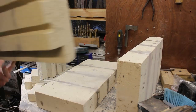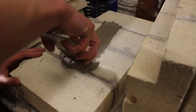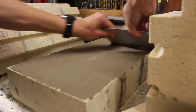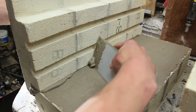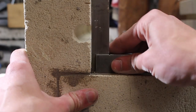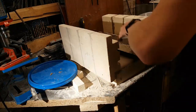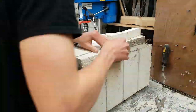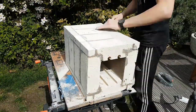Now I've basically got all the bricks shaped and it's time to start gluing them together to make the main chamber of the heat treat oven. The first thing I did before gluing everything together was take the refractory mortar and make a layer of it along the base piece - this is going to mean the floor of the oven is much tougher and harder. This unfortunately doesn't reflect heat as well as the actual fire bricks themselves but it's worth it for the added toughness and strength. After making that layer nice and consistent along the bottom and letting it dry slightly, I started to assemble the whole thing together, using loads of mortar and making sure to fill all of the gaps between the bricks. After leaving it to dry overnight it's completely solid and I'm happy with how square everything is. Next I glued on all of the corner pieces to complete the structure, then used an old metal file to flatten everything out and smooth all of the edges.